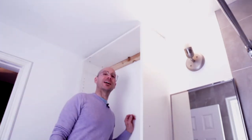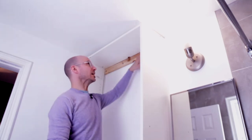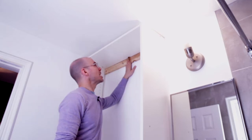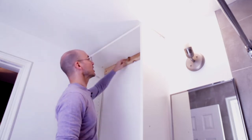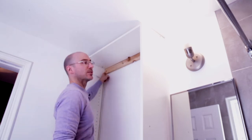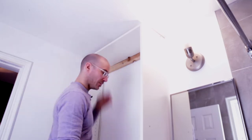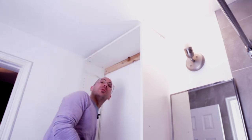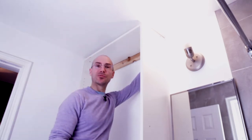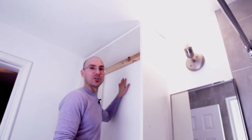You can see that I have put up the bookcase temporarily — it's a dry fit, meaning I haven't affixed it with any nails or screws yet. But it is sitting in place between the spacer and the new piece of strapping, tightly against the wall. Now that it's sitting in place, I'll be able to do the strapping for the bottom. Then I'll remove it, clean it, drill pilot holes for the side and for the bottom, and then it will be mounted to the wall securely.